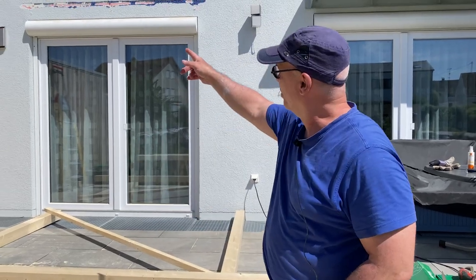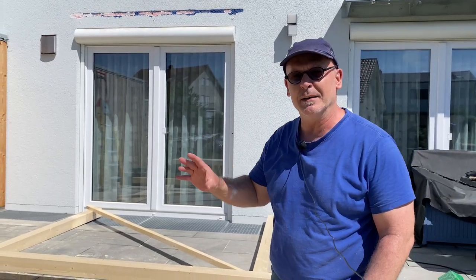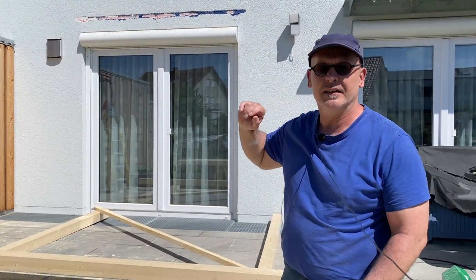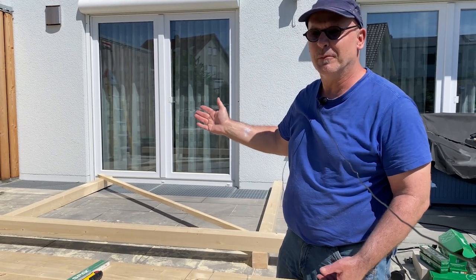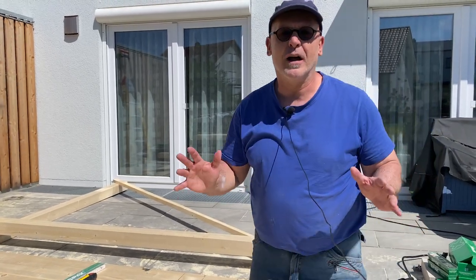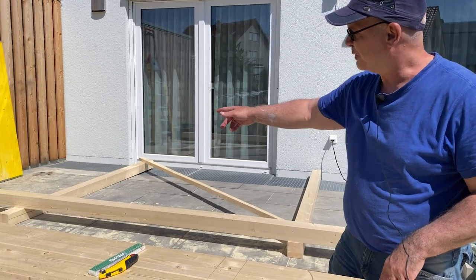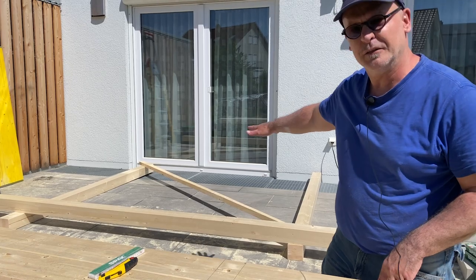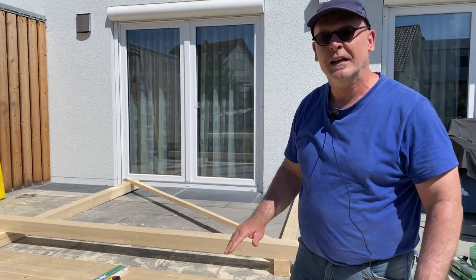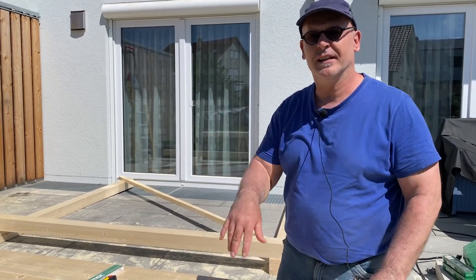Next step - as you've seen, we removed the old metal roof covering up top. A piece of plaster came with it, but that's not a problem since our Rähm and Firstpfette will go exactly back to that same spot. I measured: the holes drilled there for the old roof are at exactly 2.40 meters height, and as always in timber construction it's exactly equal and perfectly consistent. Since we have no scaffolding and no steel props but still need to get the Rähm up high, we're building a small auxiliary construction: two leftover posts, a sill at the bottom so it lies flat on the grid, and two laths to keep it rigid. We set that up, lay the Rähm on top, and since we've already precisely calculated the height, we can basically screw it straight away.